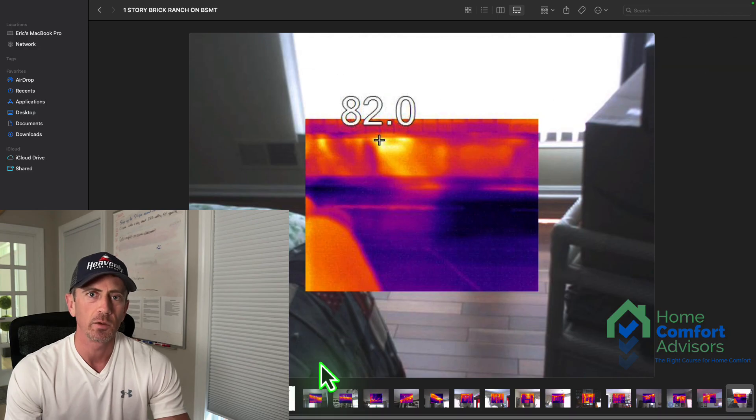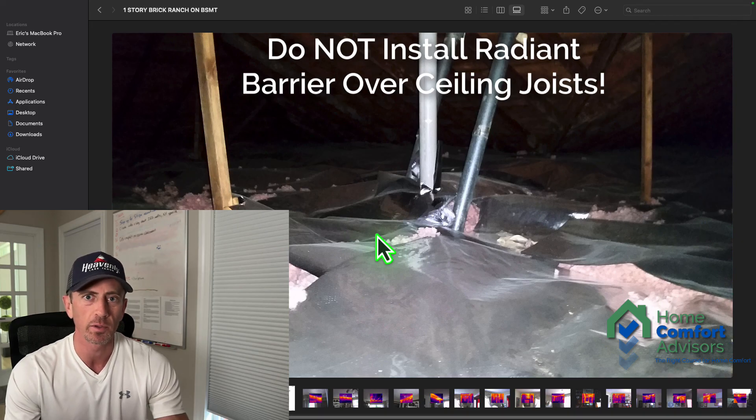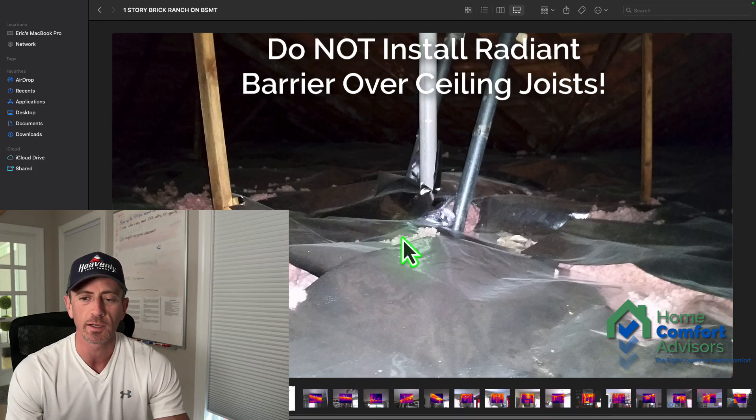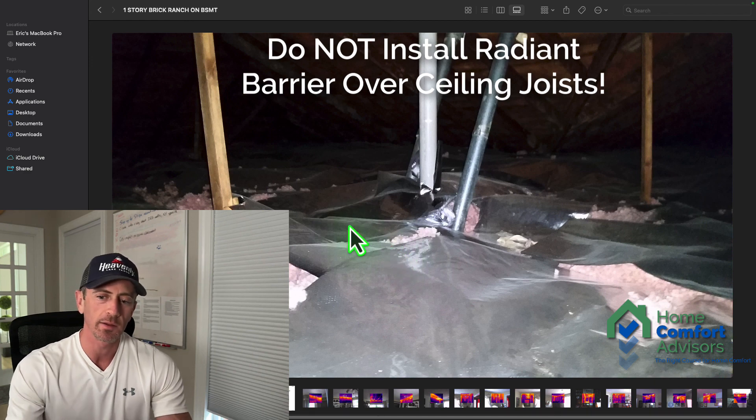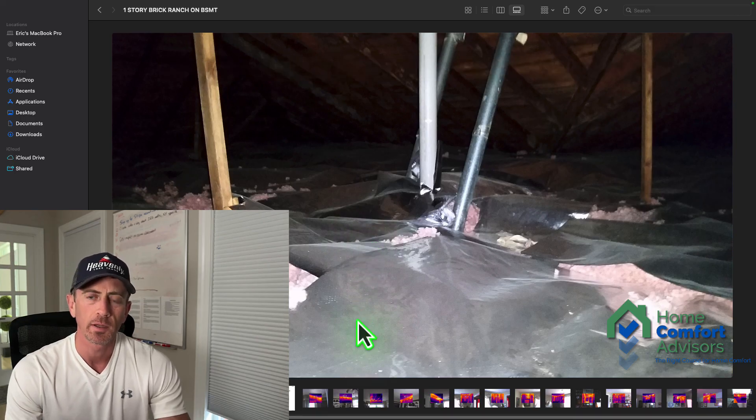There are really other things you should consider doing before investing in insulating exterior wall cavities, whether with injectable foam or cellulose. Typically you want to air seal the house first at the top and bottom, and make sure the ceilings are well insulated. I do not recommend installing radiant barrier on top of your ceiling insulation in our part of the country — it's not part of the building code here, and even where it is code-required it can cause problems if not installed properly. This was really just a big waste of money. I hope this helps you save money and avoid making a mistake.